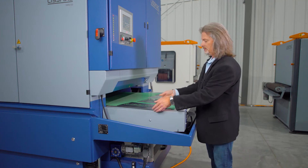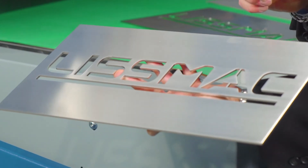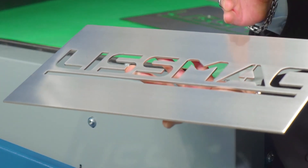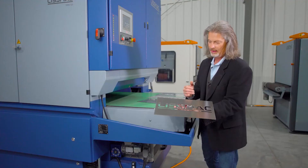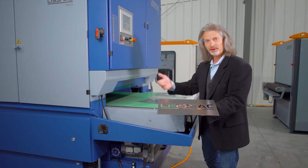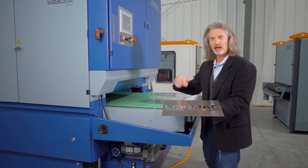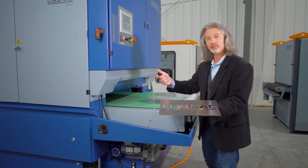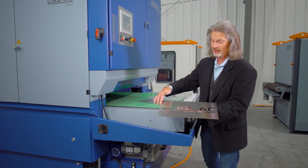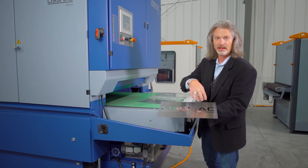On the stainless steel surface-finished part, this would be an example of an RBB configuration, where we have the R — the abrasive head, which in Lismac nomenclature also means roller — and then a barrel brush going with or against the feed, and then a third head which is a second barrel brush going in the opposite direction of head number two. So if head number two is clockwise, head number three would be counterclockwise. That way we get leading edge, trailing edge, lateral edges, and everything in the middle.